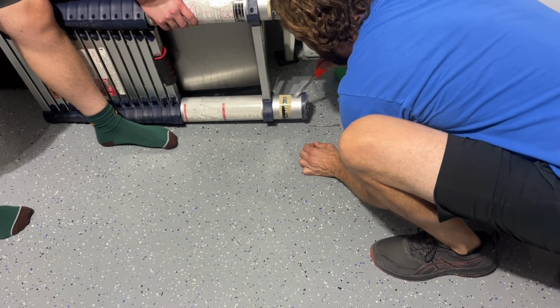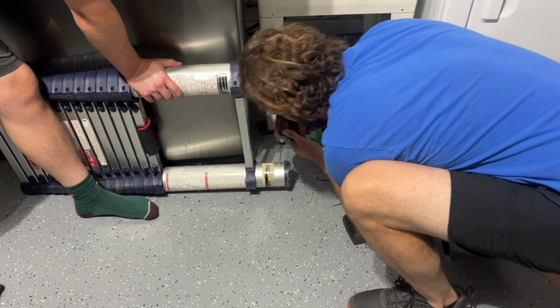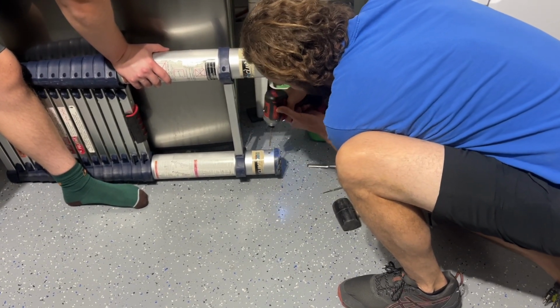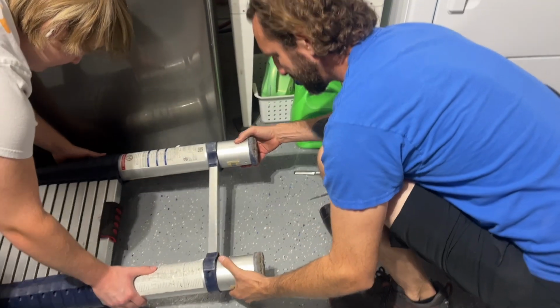And that worked well. For the rest of it, you always want to use a drill bit that's smaller than the rivet hole size because you don't want to make it bigger. There, now the rest of it's pushed through. So let's flip the ladder and do the other one, please.